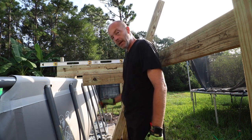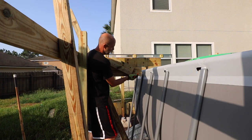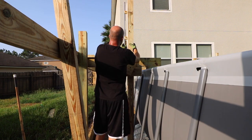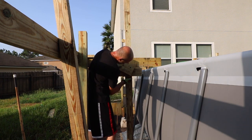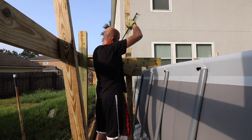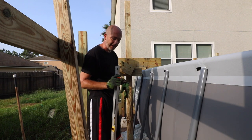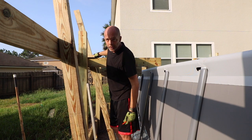So let me move you to the other side. We'll stand this post up and I'll show you how I mark it. This is the back side — here's the board that connects this 6x6. If I can stand this post up and put it into there, I know this is level. I can then get this post level and mark it. That makes sure I know where to cut. I'm going around marking each post, and then as I take them down one at a time, I'll go cut them and bring them back. So that's the excitement right now — one at a time, mark them, then go cut them.